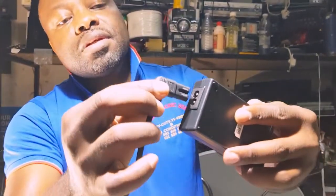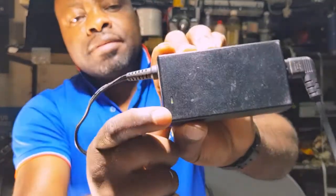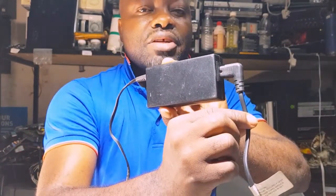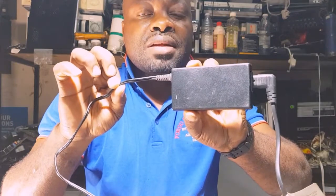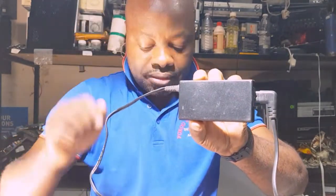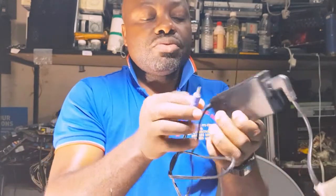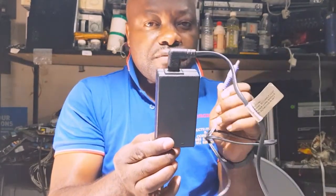I'm going to plug it in — look here, you can see the light is now on, it's green. That means I can assume my power supply is receiving 220 volts. It might be working, but to confirm I have to use my multimeter. This power supply transforms the 220-volt AC to DC — 12 volts, 3.7-amp. I need to check this output end to confirm it's giving me 12 volts. If it gives 12 volts, the power supply is fine; if not, the power supply is not good.